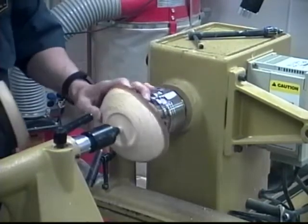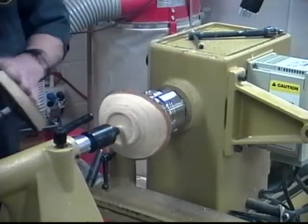I made a rocking chair once, and when you cut the rockers on those, you cut them on a bandsaw, and then they're pretty jagged. So what I ended up doing is I took the scrap piece, which was almost the female part of that curve, and I double-face taped sandpaper on there. And then I rubbed the two of them together like this, and the curve just came out beautifully. And so that's the concept if you're trying to blend in a curve: try to get the two surfaces that match really well like that. So what I'm going to do is I'll just sand like half of this, and then you'll see how it was when I started, and then you'll see how it went.